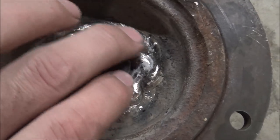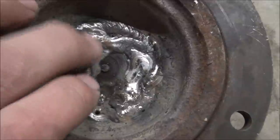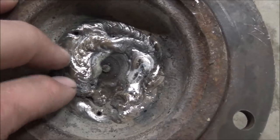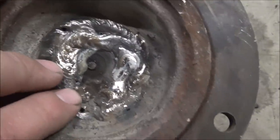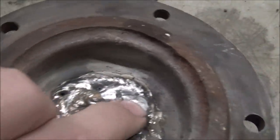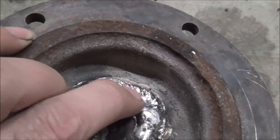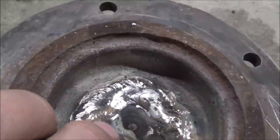This first rod I used worked better than this second rod. I had a hard time getting it to lay down right, so that makes this ugly. But ugly doesn't affect how it works. Could machine it out, but once it's bolted together, it'll never be seen. Y'all will be the only ones to ever know about that ugly weld job. It's good where it ties in. It's just where I welded back over it.